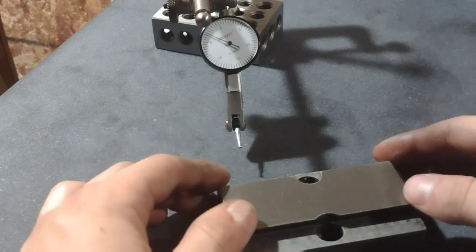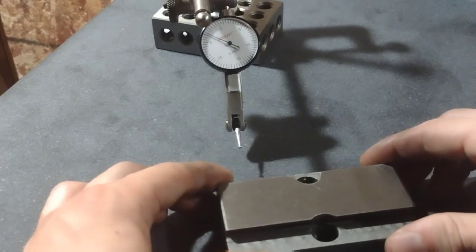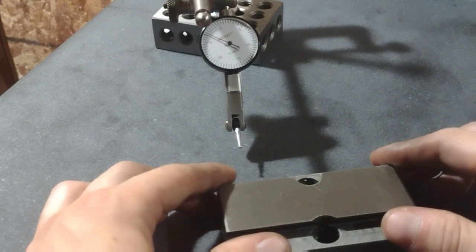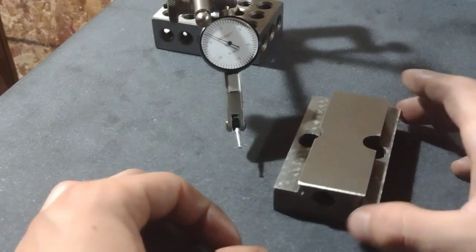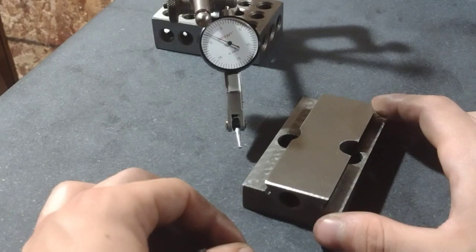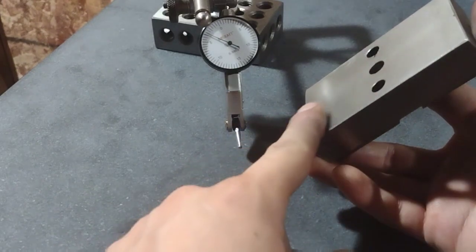If it were the other side, I would be like, oh, okay, yeah, the cutting forces, it's going to flex a little bit. The extra height is going to make it cut more on center. But this is sort of the inverse of what you'd imagine. So what I'm going to attempt to do, as I don't have a surface grinder, is just go ahead and try to scrape this other side in and slowly remove material from this side.